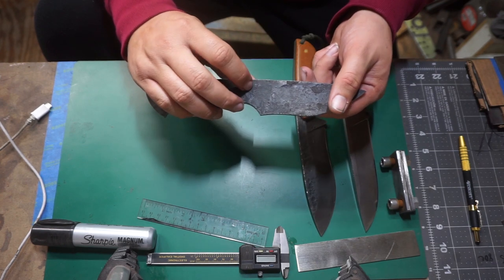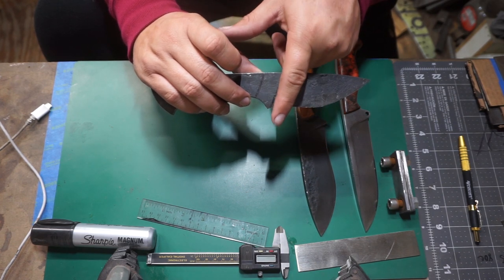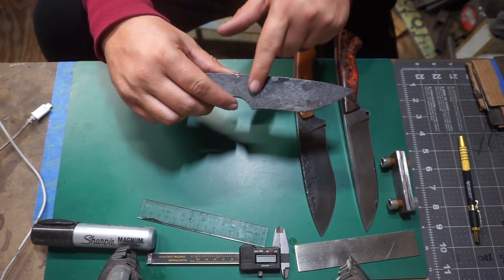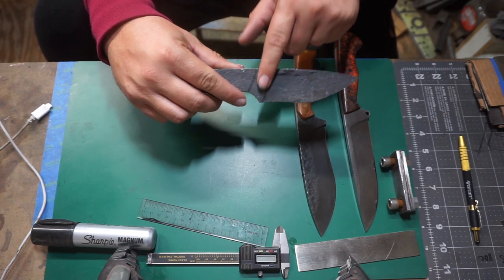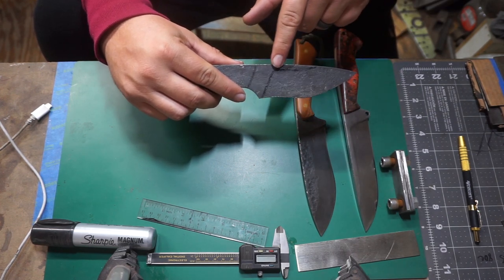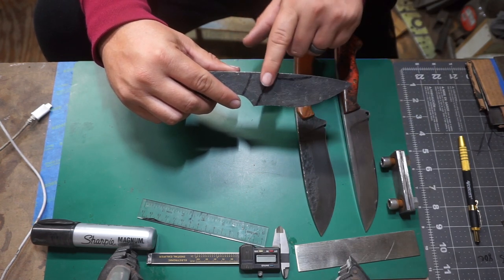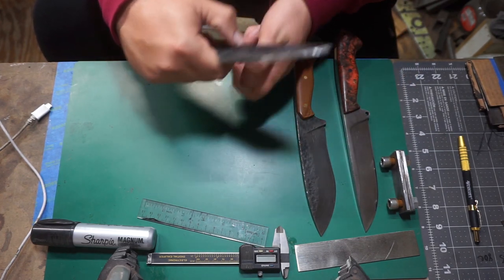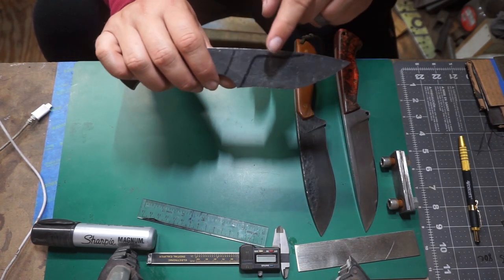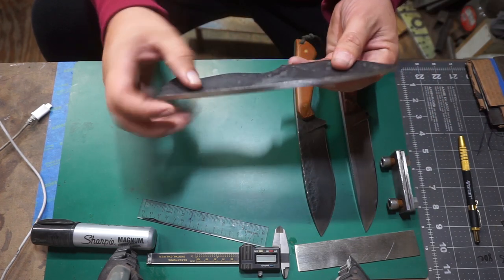This area plays a lot of importance when it comes to my ricasso and plunge line designs. For a forged knife like this I like to actually leave the forged finish on the ricasso and up top of the knife. One of the big reasons I'm leaving flat areas is because this knife is built to strike a ferro rod and throw sparks well — it's got a 90-degree spine, 90 degrees where the flats meet the spine and meet the flats again. It throws sparks really well when you do that with a high-carbon knife.